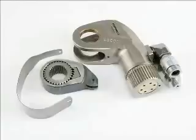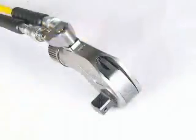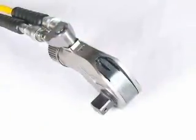Reassemble the components in reverse order except the housing guard. Make sure that the crank, drive shoe, ratchet, and crank pin are correctly installed. Failure to install these parts correctly will result in component damage or injury to the operator. Connect the tool to the pump. Check the tool at nominal pressure to make sure the piston advances and retracts. Attach the housing guard.